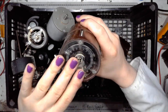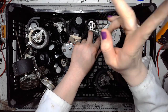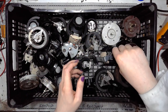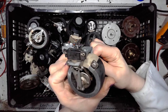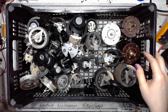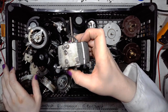Physically, a rheostat is linear, because if you wanted to make a logarithmic or exponential rheostat, you would have to use a changing thickness of the resistive wire, and that's almost impossible to make. So rheostats were exclusively linear when it comes to the characteristic, unlike audio potentiometers. I also have one of those rheostats that was damaged, which would be a perfect opportunity to do a teardown.